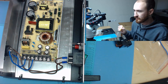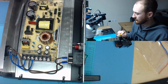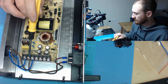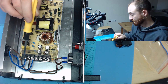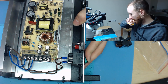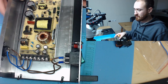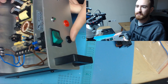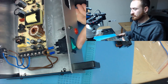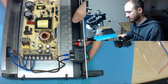You can see here that I already connected the main power of the power supply. This is the ground — we will go to the ground. And the two AC inputs and the switch between them. So it's going to control basically the AC input on the main power supply. And then I already added the plugs here for the cables — an LED that I will connect and it will light when the main power supply output is 24 volts.